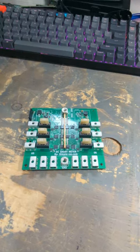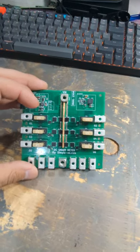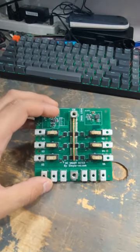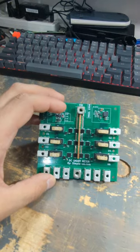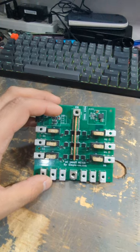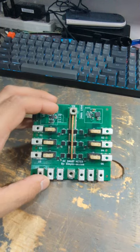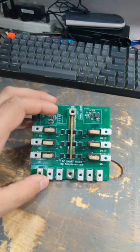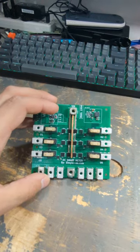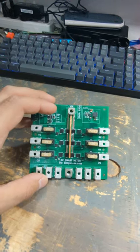You'll be able to monitor each circuit leg to see what your loads are doing. Since these are bidirectional FET switches, another use case is for one of my BMS projects — I have a negative load and a negative charge. Instead of having charge and discharge on the same negative leg, I switch them so one leg is for charging and one is for discharging, which gives me the ability to protect my battery.